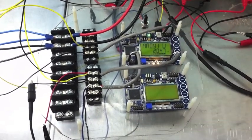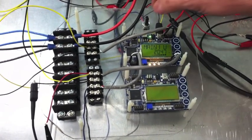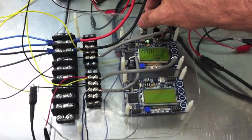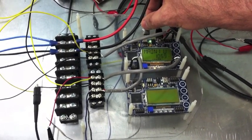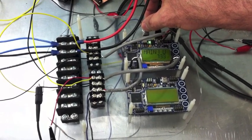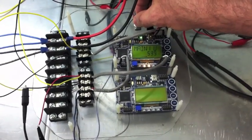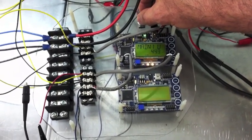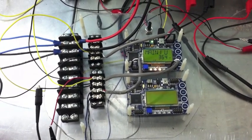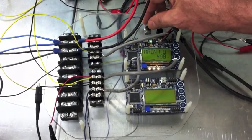When we get up to about 2,000 we're in full power mode, forward on the thruster. As we bring this back, we'll cycle back through idle, and now we're going in reverse. You can hear the motor running over there — it's in reverse, and we'll show that here in a minute. We'll bring this down to about there for full reverse. That's the motor — or the propeller — cavitating in the water a little bit. And we'll bring that back to idle.